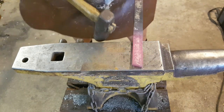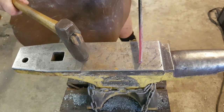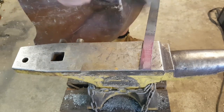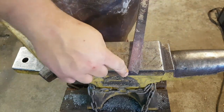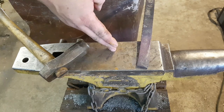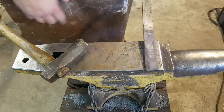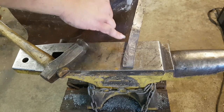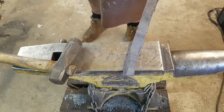You can tell it's late in the day — my hammer eye is not as good as it was. You always want to be working both sides of the material. As you can see, I'm trying to develop a very tight piece. We have a defined edge bevel with slight radiusing, and I would work this piece up from the edge to the spine. In forging by compression, you want to work tip in. Although my hammering skills today leave something to be desired, you can see how I've developed that forge line on both sides of the bevel, and our width has not increased dramatically.